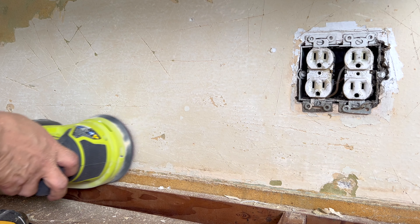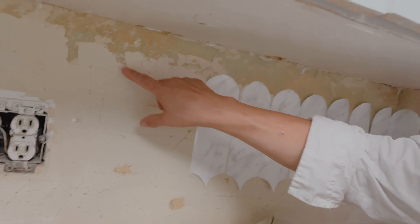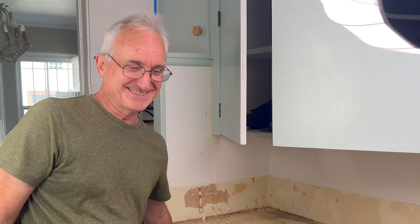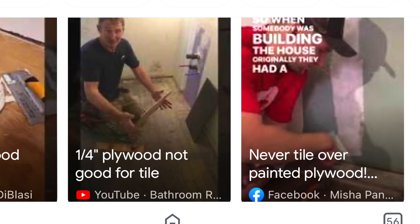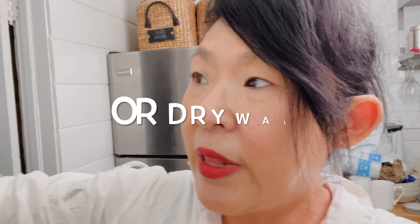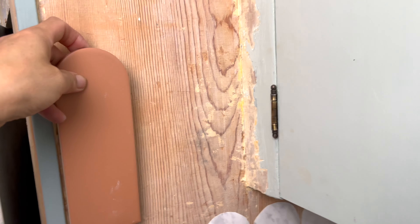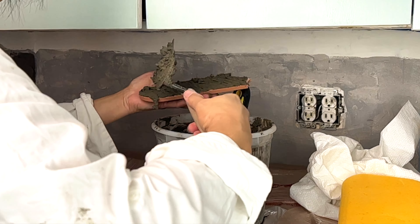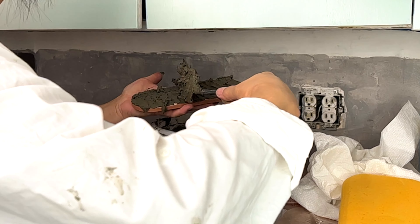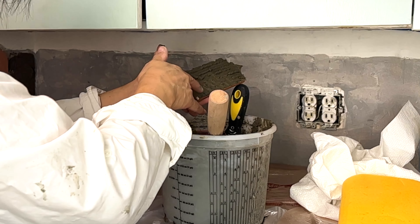It is a really weird surface — I don't even know what it's called, like a sheetrock type — and the paint wasn't coming off, so it is a mess. I had to call my contractor friend Joe. There's so many things online and I didn't know who to trust, because you can't ordinarily put tile directly onto any kind of plywood — plywood absorbs water differently and absorbs the mastic differently, which could create cracks and problems down the line. Joe thought that because the tile was not going to be used for flooring, I should be fine tiling directly over the plywood. I stripped the plywood of all the paint, or as much as I could get off.